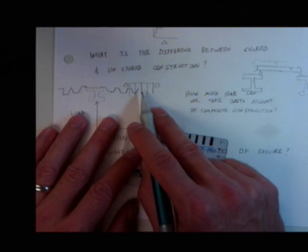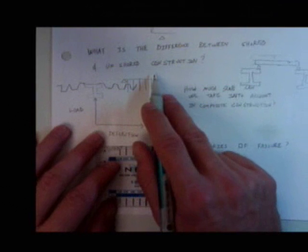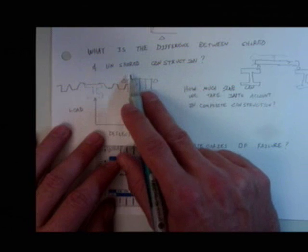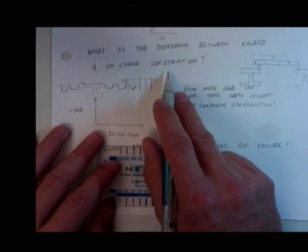Okay, great. So why do we care about this? Shored versus unshored. We're structural engineers. Why do we need to know about this? Cost? Yeah, there's more reasons. But yeah, cost. What else? Deformation. Deformation of what? What's different between shored and unshored? Unshored, you'll get immediate deflection due to the pour. That's exactly right. And shored, you don't.